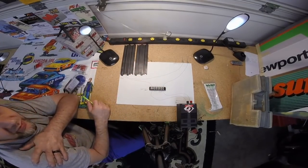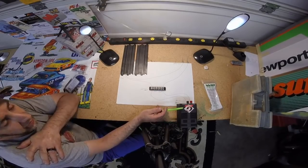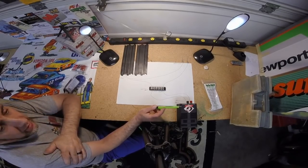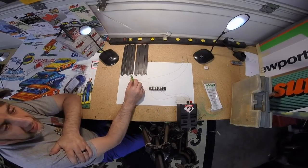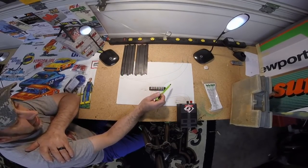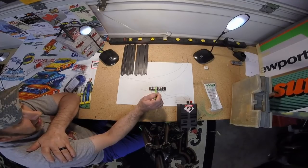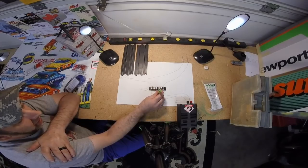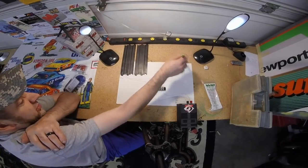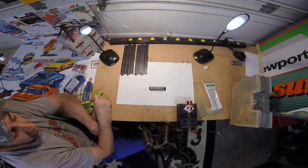This is your diagram — remember it may vary depending on the power supply you have. If you're using the new Track Mate timing system, the power supply may go straight into the box under the track, then from there up to a terminal block, and then from the terminal block to the track and into the driver's station. Also, if you have a relay on your racetrack, that would probably go before the power block — so it would go to your relay, then to the power block, then to the driver's stations and to the track.